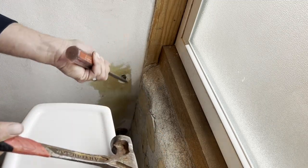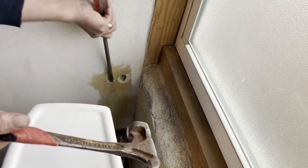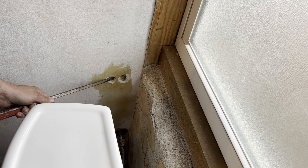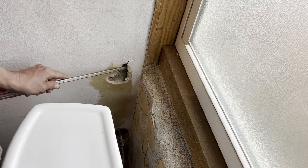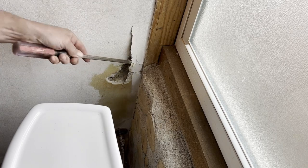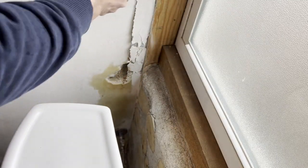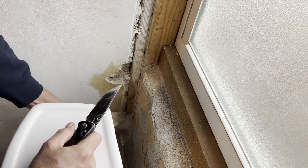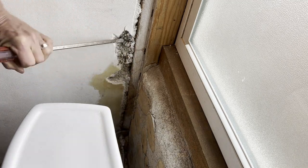Using a big flathead screwdriver and a hammer, I chipped through the plaster to expose the dustcrete beneath. I found that it was relatively easy with these tools to dig away at the dustcrete. It still had good integrity. I used this fiberglass drywall reinforcement tape to prevent the plaster from cracking between the wooden framing member and the dustcrete, and that worked pretty well. So digging that out of there, that exposes the rest of the dustcrete section that I need to remove.